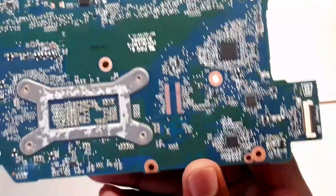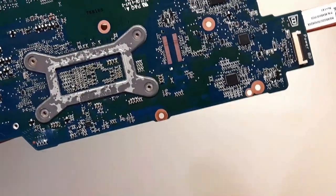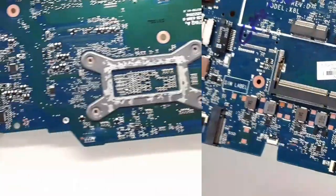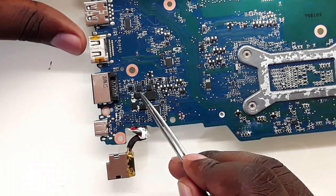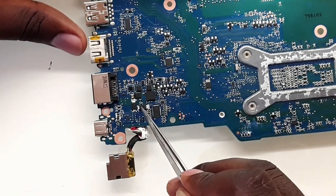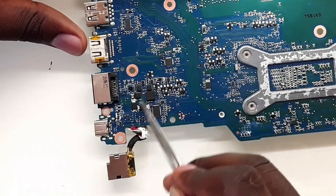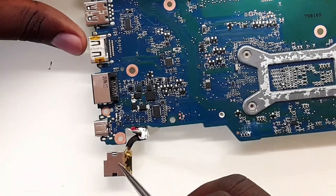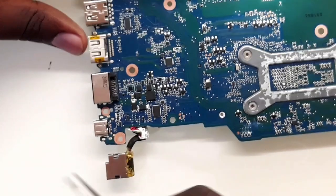If I'm not able to see the short by physical observation, I will use a power supply and inject voltage into the motherboard to find which part is short to ground. At the input we have two pairs of MOSFETs: a diode, first MOSFET, and second MOSFET for each pair. One pair is for the main charger and the smaller one is for the Type-C, which can also be used for charging and powering on the motherboard.